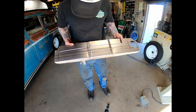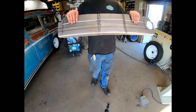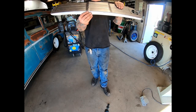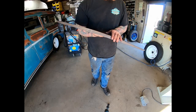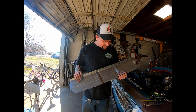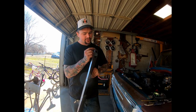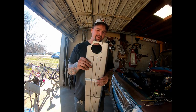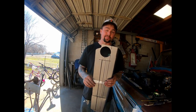I ain't mad at it — most of those tooling marks right there will sand out. It didn't appear to work a whole lot but it is a little bit. We could do some shrinking and stretching on the front to clean it up. Let me see how it fits real quick. It looks like it's actually fitting up there decent. Next thing I'm going to do is around this curve right here — try to shrink that some, maybe break this end down a hair so it's not just a flat end. I should have accounted for that before.